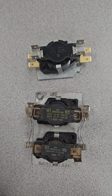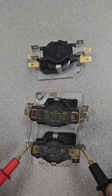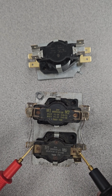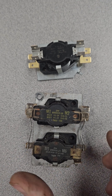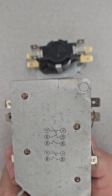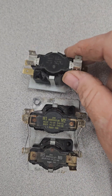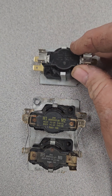What we're looking at here is a heat sequencer. On the bottom portion of the sequencer is the heater. On the top portion of the sequencer is the switch. Some sequencers on the back side of them may give you a schematic drawing of how it's wired up. It can be a double sequencer like this one or a single sequencer like this one over here.